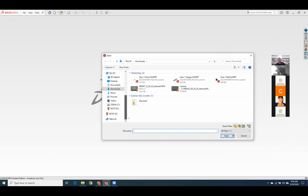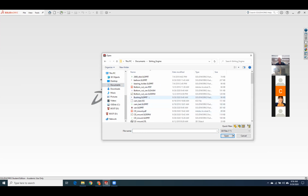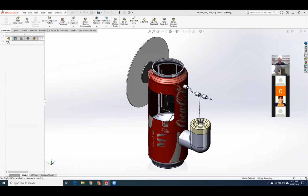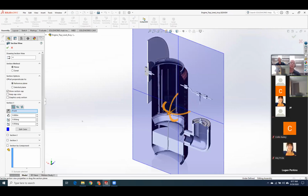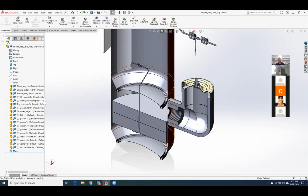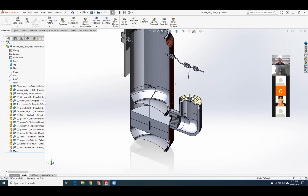Well, let's take a look at what is major. So I was thinking I could also show mine too. Okay, so here's my layout. I was talking about the inside of the top of the can. Yeah, so the top of the can, you're going to have to cut away. Okay, so it doesn't matter then. Yeah, there's nothing that critical up there. However, on the bottom of the can, getting that geometry right is important for how much room you have for the displacer to move. Ooh, okay. That means I need to. Okay. So yeah, you need some pretty good fidelity down here.